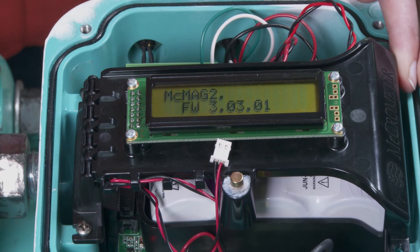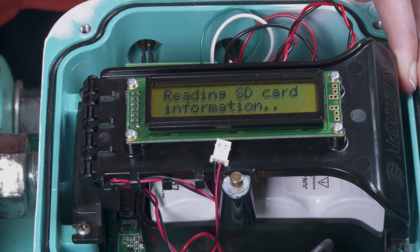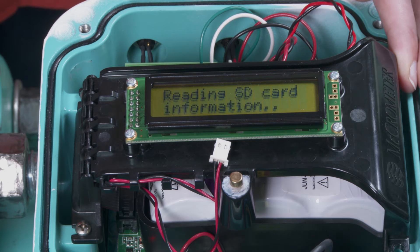Set the hinged LCD internal battery cover back in place to see the display. The unit will start to power up. You will see the start screen as it goes through the boot up mode. Ensure that the unit is powered normally and that there are no alarms.